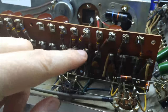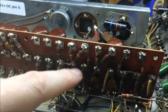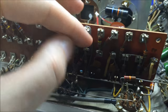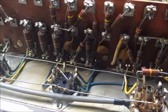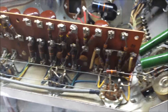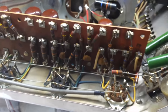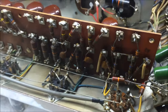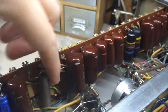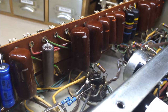If the camera focuses enough, notice that lead I brought through — I bent it up, over, and back down around the turret before soldering. What I've got is the lead coming through the other side, bent up and tightly pulled to make a physical connection, not just solder holding it in. I'm a big fan of the physical aspects of wire holding in place rather than just running it through and dropping a bead of solder and hoping it holds. As you can see it's nicely soldered at the top and bottom — a bit shinier than the 50-year-old solder. I can align it up really nice and neat because I know it's physically connected.